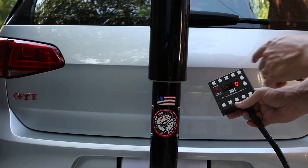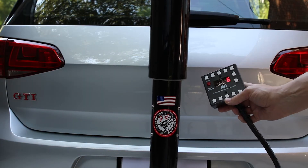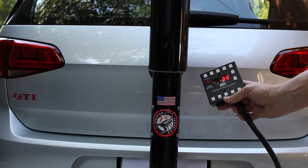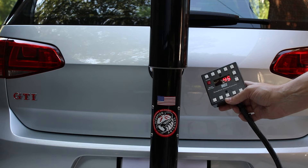I can program those turn counts into the MFJ-1924. That way, all I have to do is push a button, and while the antenna is going up to that position, I can fidget with my logs or do something else rather than just hold the button. That was convenient, and then I would fine-tune once I got close, hopefully not on top of a conversation in progress.